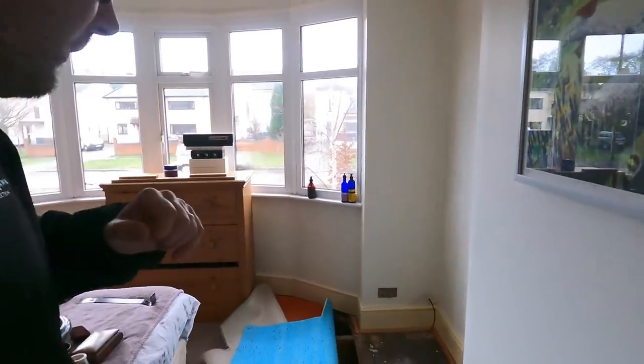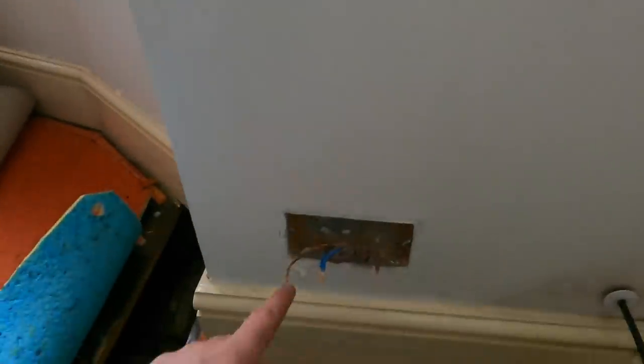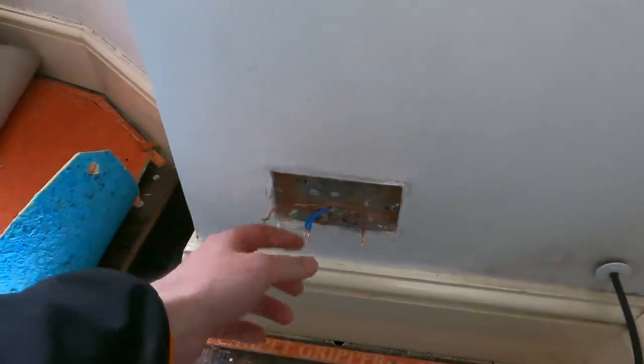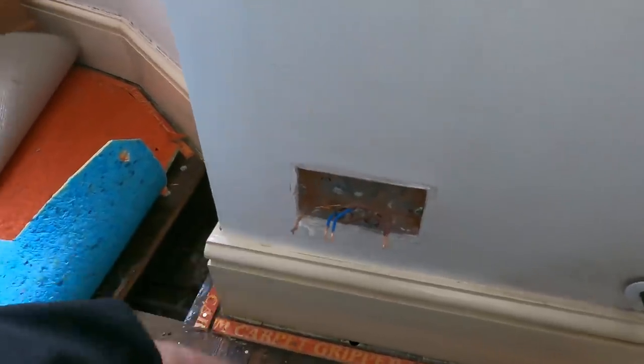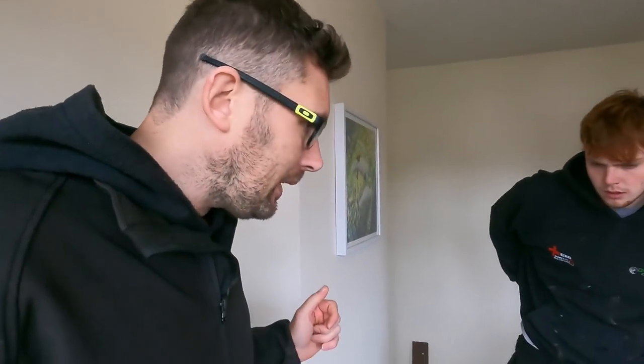But it's just really bad workmanship, a lot of this, which has led to loads of different problems. So you can see we've had alterations that have happened, and clearly DIY sort of stuff. So not great, and this is what's caused a lot of the bad readings and results. And we've had old cables spliced into new ones, but not done properly. I mean, you join stuff, that's fine, do it properly, that's not a problem. So like I say, we're about ready to start running cable now.